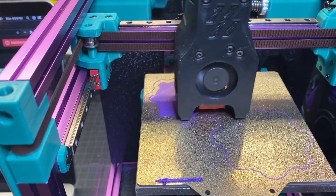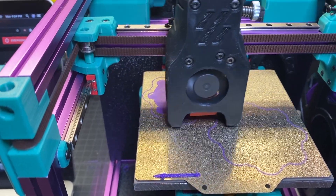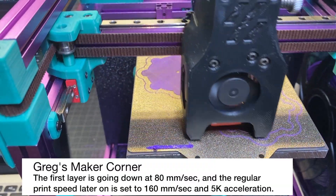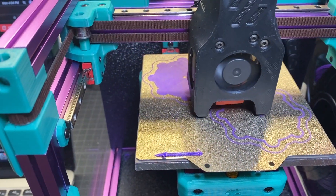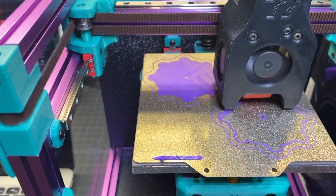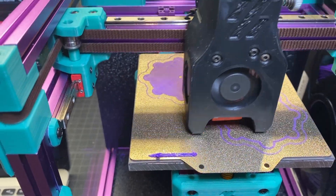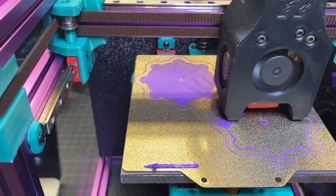During the conference I was experimenting a little bit, just doing some changes and tweaking things. What I really found is that probably about 160 millimeters per second is right — I probably could push the first layer even faster if I wanted to, but I don't want to. I think this is about right. One thing you'll notice: this first layer is a little low. I actually haven't even re-leveled my bed since MRF, so I probably need to do that, but I could probably raise the Z height just a tad. It's looking pretty good.